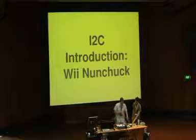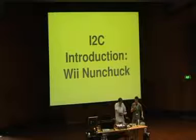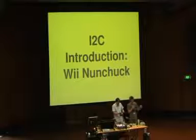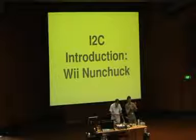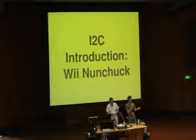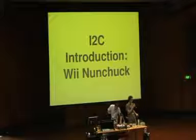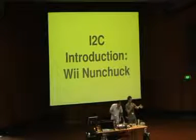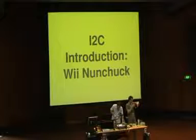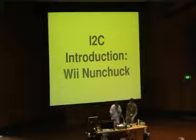So what we'll do is connect this up to... The demo gods have been a little unkind to us. For those of you trying to get the Dallas one-wire sensors going, the newer boards have a LED across the same pin we're trying to read the data in off, so we'll need to rejig that circuit to suit those boards. If you're getting zeros, you haven't done anything wrong, it's just because there's a LED on that pin, so it's not able to actually access the device. We'll work out some way, we'll send a patch, basically. Sorry, that's my fault for using old technology.